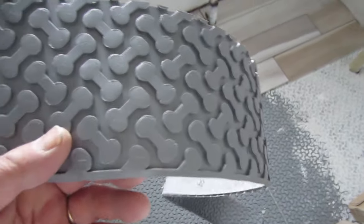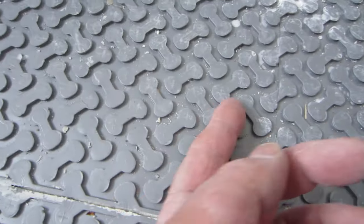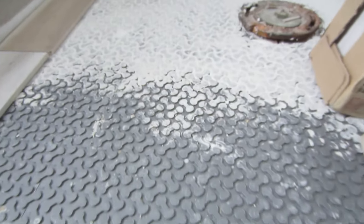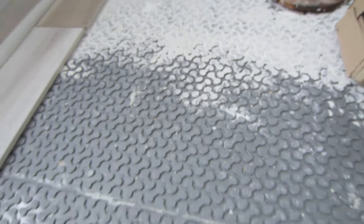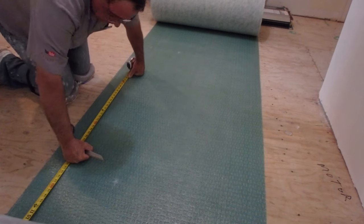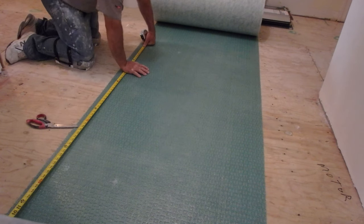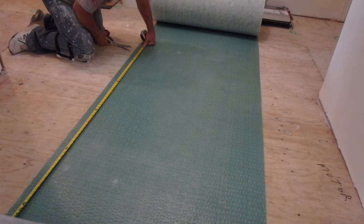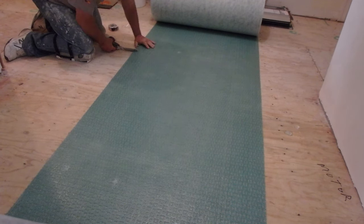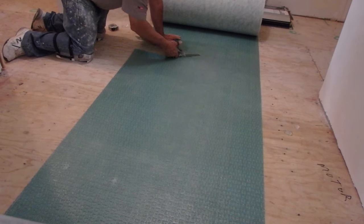It's actually better than a cement board because it uncouples the floor. The structure of the mat has little ridges that overlap the low part, so when the thinset hardens, it gets locked into the mat. If there's any lateral movement in the plywood, it can deform and not transfer the movement to the top. According to the TCNA handbook, an uncoupling membrane is a plastic membrane system geometrically configured to provide airspace between the tile and the substrate to allow independent movement between the two and limit the transfer of stress.